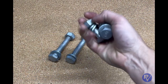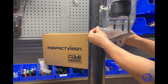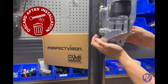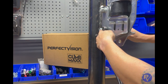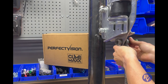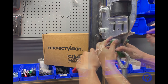Install the head assembly onto the vertical tab plate with the provided half-inch by one-and-three-quarter inch bolts. The longer half-inch bolts are used for square tube installations. Now that the head assembly is loosely bolted to the vertical tab or anchorage, remove and discard the carriage bolt and wing nut. Once the carriage bolt is discarded, tighten the head assembly to the vertical tab or square tube. Now connect the factory terminated end of the wire rope to the head assembly using the included shackle. Don't forget to install the cotter pin back into the shackle.